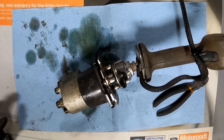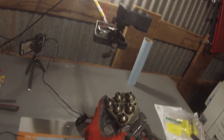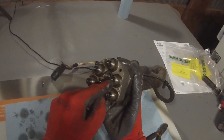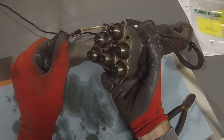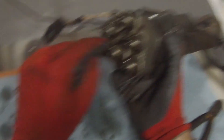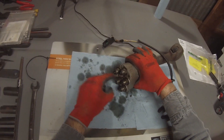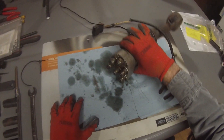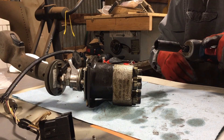Next I'm going to pull all these hydraulic fittings out. You can't see it from this end, but the four that actually go to the pilot stage on the spool valve bank are orificed fittings. You can interchange any of these four — that's fine — but you can't interchange these four with these two, which are your P and T ports. P being your pressure port and T being your tank line.